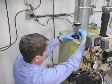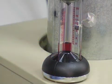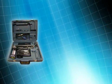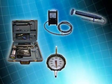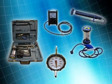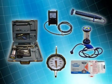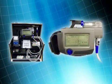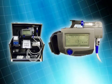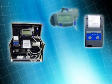See the manufacturer's instructions for details regarding pre-use checks and maintenance intervals. A manual kit includes a draft gauge, a smoke tester, a stack thermometer, a CO2 tester, and a slide chart to determine combustion efficiency. An electronic test kit consists of an electronic analyzer with a built-in pump that draws flue gases through a series of sensors. An optional printer may also be included.